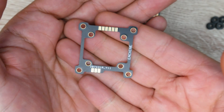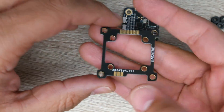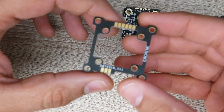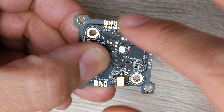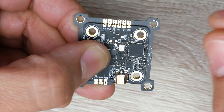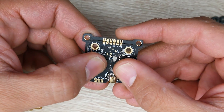If we take a look at the adapter, it'll allow you to run your 20x20 and also convert to a 30x30 if you put this on the bottom. To convert this into a 30x30, you want to align these, and before you start soldering, solder one side first and make sure it's perfect — it'll be a lot easier to make adjustments when just one side has solder on there.